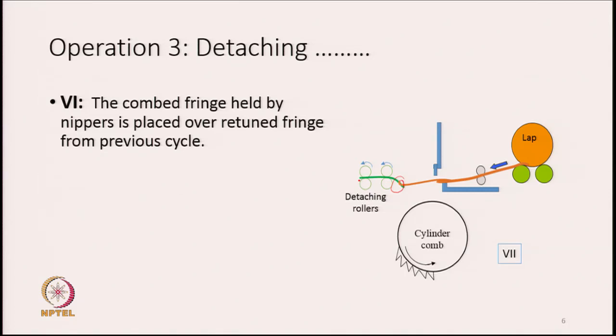But prior to that, what is happening? What was detached in the previous cycle? That is the green part. If you concentrate on this, the green part is the fringe which was detached in the previous cycle. What we do here, in order to create a continuity, the previously detached fringe will be fed backwards. So, a little tail of the previous fringe will be hanging here as you see in this diagram, and the new combed fringe which is coming towards the detaching roller nip will actually fall on the top of it. So, that here there will be overlapping,